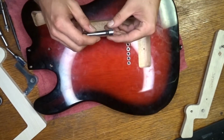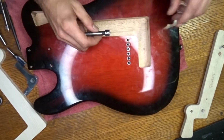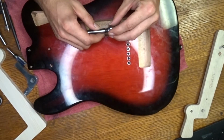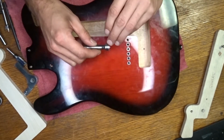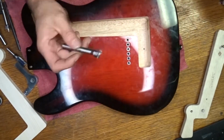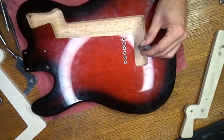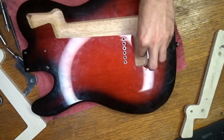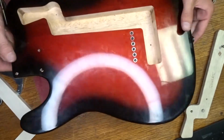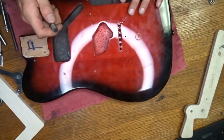Now, similar to the 1/8 inch bit, I put a mark on this one roughly in the area of where my bearing depth is, as you can see there. Now I'm going to chuck this bit up in my drill press and drill down to that depth so I can countersink this bearing into the hole. Then once we've done that, we're going to flip it over and do the same thing on the other side, but there's one step I want to go over with you right quick.